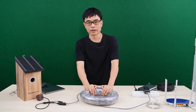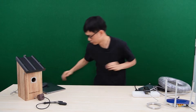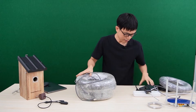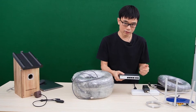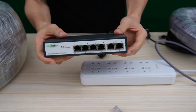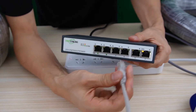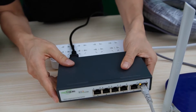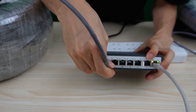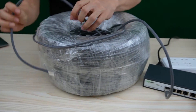First, I need to replace this cable with a 1000-feet Cat5 Ethernet cable. We don't need the old cable anymore. This is the 1000-feet Ethernet cable. Next, we'll replace this PoE injector with the long-range PoE switch. This switch will supply both power and data to the camera. Let's power up the long-range PoE switch and connect one of its ports to the router so we have data from the router. Port number one and two can supply long-run PoE network.